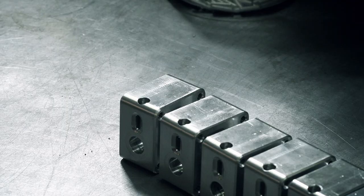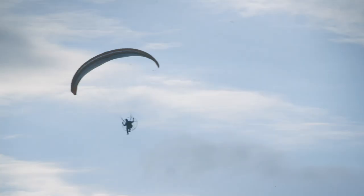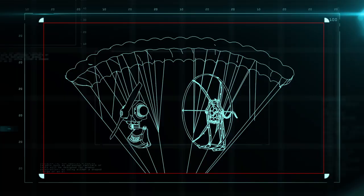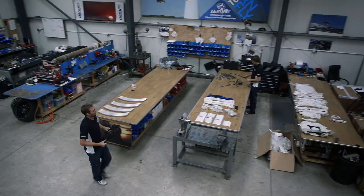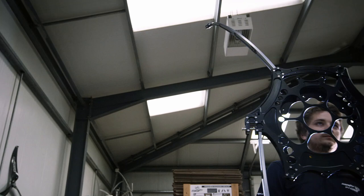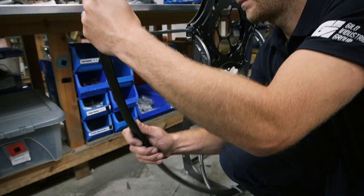This fit has to be perfect to withstand wind and engine vibration — it can't come apart at three kilometers in the air. Once the metal pieces have been cleaned and measured, they're shipped off-site to be treated for strength and weatherproofing. The freshly treated parts are returned to the shop floor and assembly of the airframe can begin. First, six bars are clipped to the base plate to form the framework. Curved aluminum completes the cage, which protects the pilot from the propeller blades.